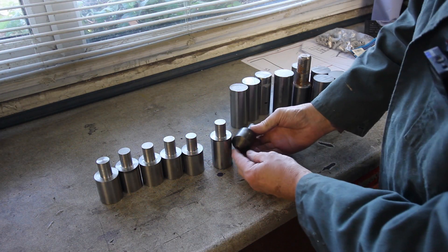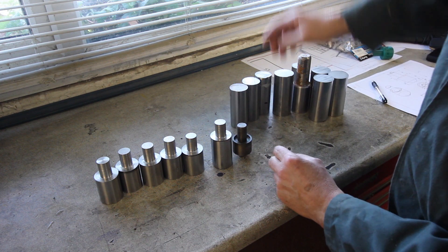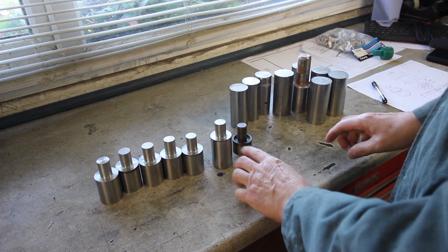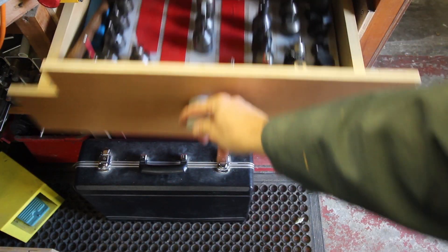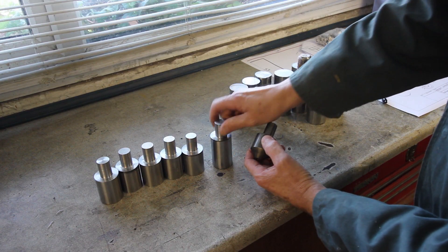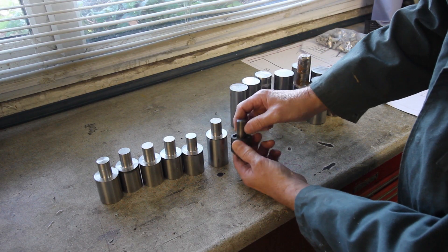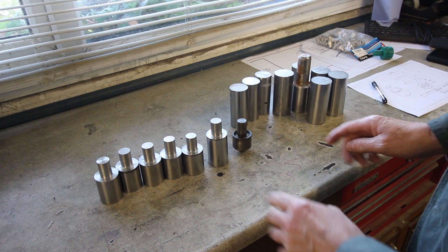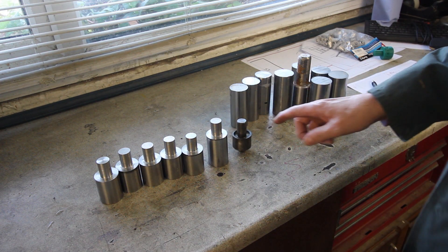This is where we are — that's what we're going to make in various lengths and a couple of different diameters. I've got about 15 spare holes on the tool pallet and I'm just turning these blanks down with this spigot, an oversized spigot, just to basically hog off all the material I don't need to get them more or less to the right size.